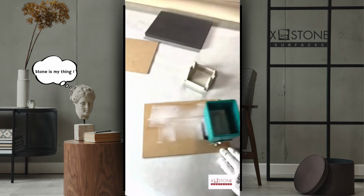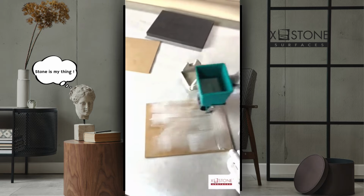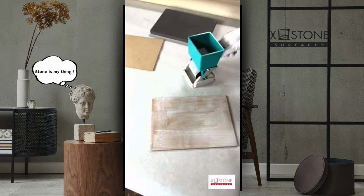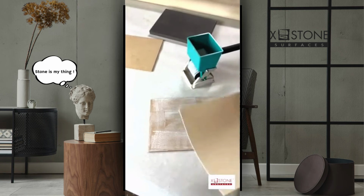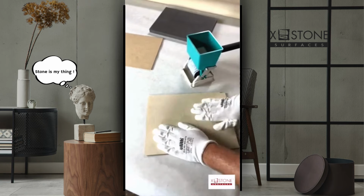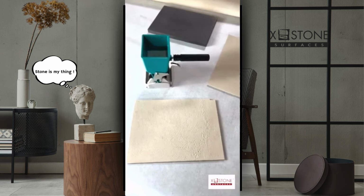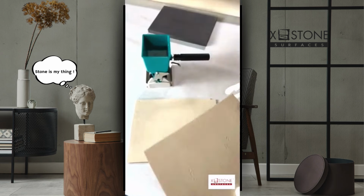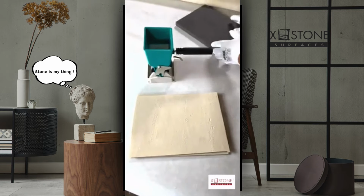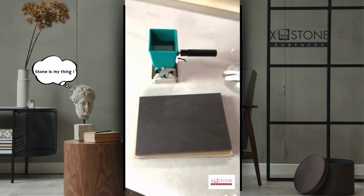So for gluing and pressing, apply your PVA to the wood and put the pieces over. You can press it with a normal wood press, but you can also put the pieces one over another and press them with weight over one night. It's a good connection.